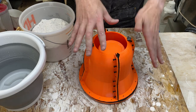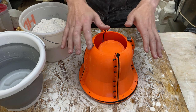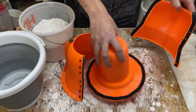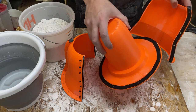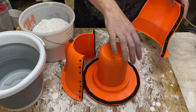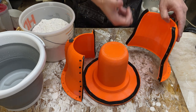The last suggestion is to try and remove some of the bubbles from the plaster itself. Once the plaster is in the mold we can tap the side and hopefully shake some bubbles free so they rise to the top. That's part of the idea behind why we pour the mold this way - we want any bubbles to rise away from the surface of the pot, winding up on the outside of the mold as opposed to the inside. That's why we're pouring it upside down.